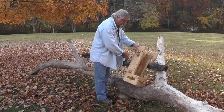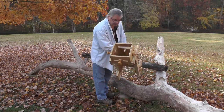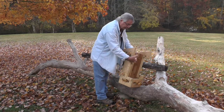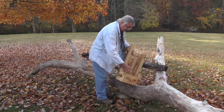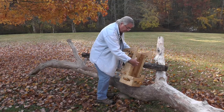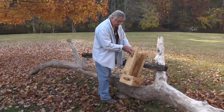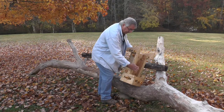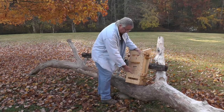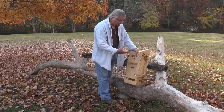It's a model 8x8 post beam seat jig. Because it's open on this side, the only clamp screw will position this, since everything is relative to the back side of the jig. We want the jig to be positioned flat against the inside face, and this side of the beam will float. I've provided provisions for screw attachment on the back side to hold this tight against the post while all the cutting is being done.